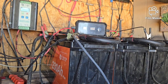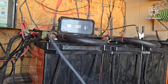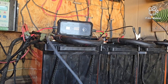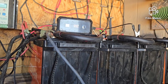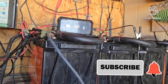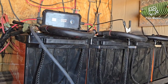If Tony and Leanne hook these in series for their 48-volt system, they'd have 48 volts at 230 amp-hours — not 920 like I have — but 48 times 230 is still 11,040 watt-hours. They get the same amount of power at 48 volts as I get at 12 volts, but 48 volts is more efficient. They will be in hog's heaven if they get four of these and eliminate all their lead-acid batteries.